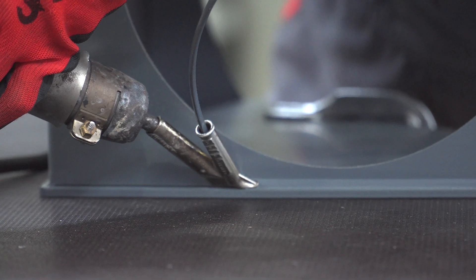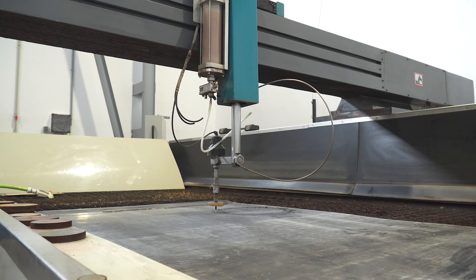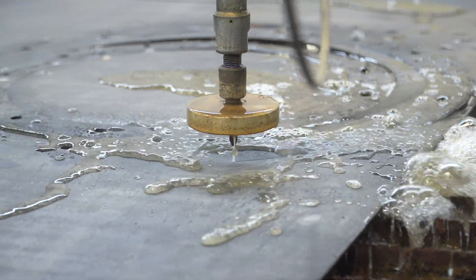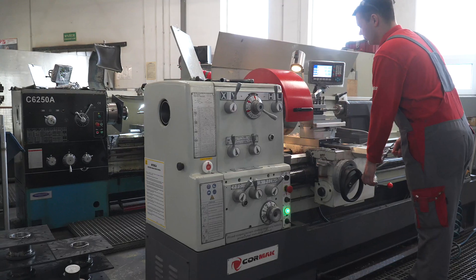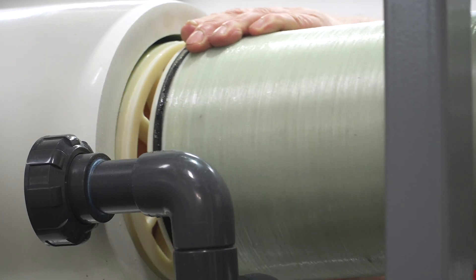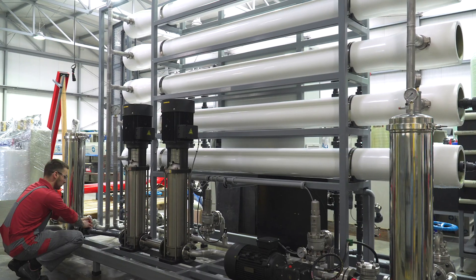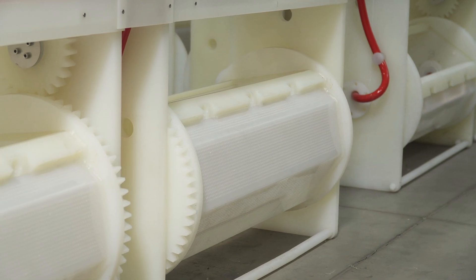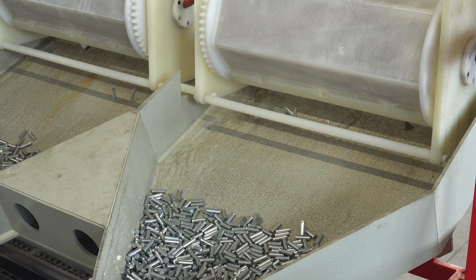Here, details for exhaust ventilation are manufactured. Components of plastic, steel, and rubber are cut out with a high-pressure water jet. Subunits for manipulators, centrifuges, and hydraulic presses are machined. At the reverse osmosis station, demineralized water is produced for closed-circuit systems. The devices shown here are barrel aggregates, used for electroplating of small details such as bolts or nuts.